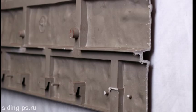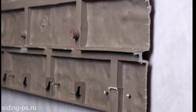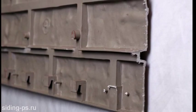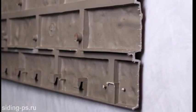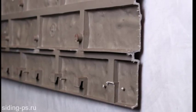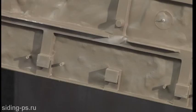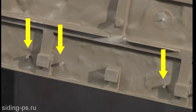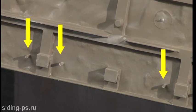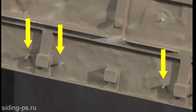When installing the brick or stone panel to corners or J-channels, it may be necessary to trim the installation fingers, spacers, and channels on the back of the panels within 3 inches of the corner or J-channel for a better fit. Like all Exteria dual-course panels, hand-cut stone and hand-laid brick panels provide positive stop posts between the back installation fingers. When installing succeeding rows of panels, don't force the panels down past the expansion posts. The succeeding panels are designed to rest on these stops to prevent buckling due to changing temperatures.